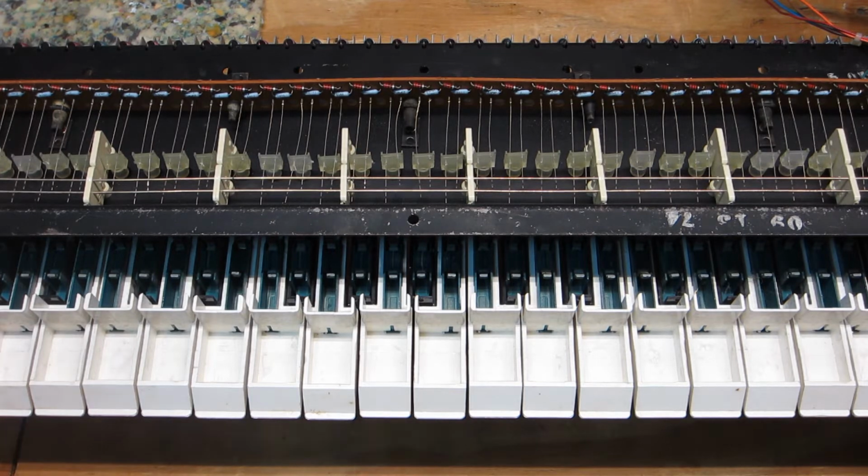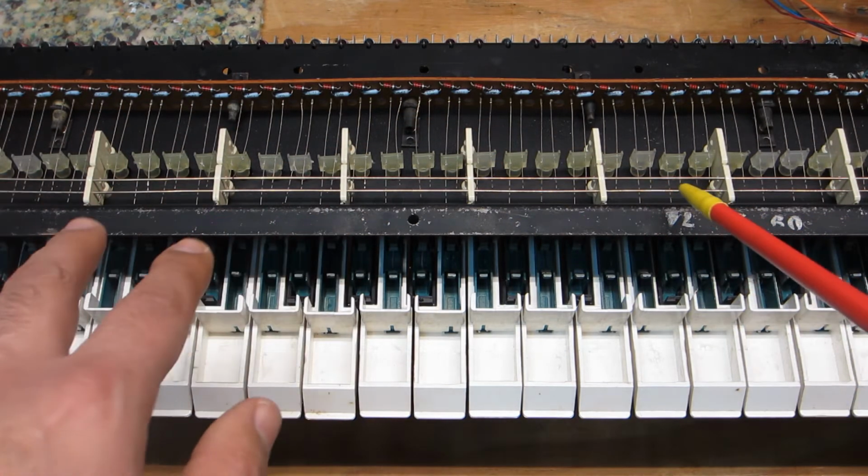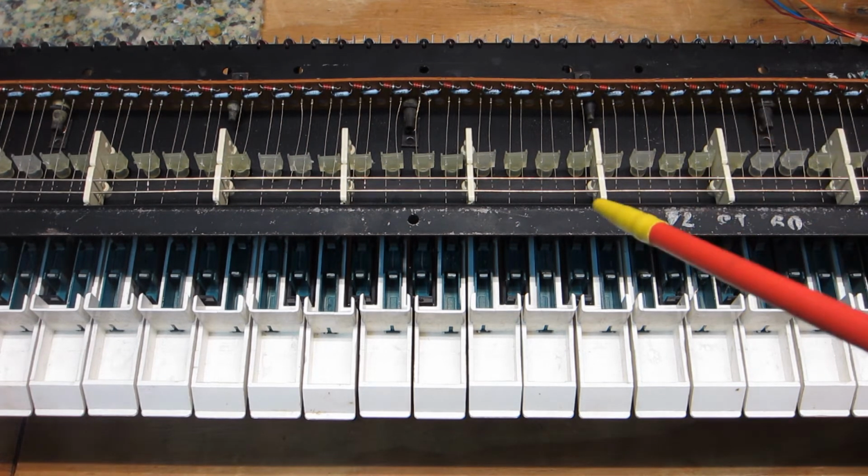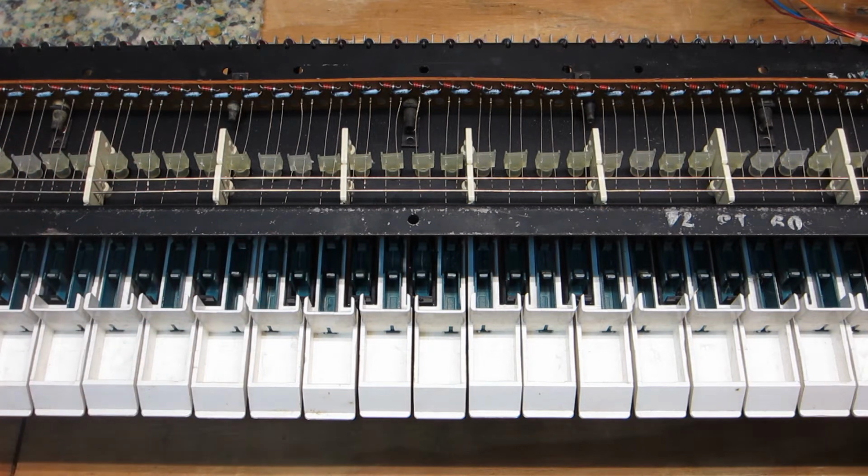And all I need to do, like I said, I have more work on solder joints, connections, cleaning connections, pins, all this area here, the bus rods, contact wires, leveling keys, like I said, new bushings, just cleaning everything up, a lot of stuff like that. But definitely am making forward progress. And then the last thing that I'm going to do, of course, is once I get everything to that point, I will perform some final electrical adjustments, suss out any problems if I notice them when I'm going through and function testing everything. If there is any issues, then I'll dive into the electronics at that time.